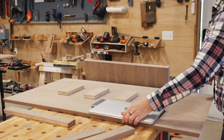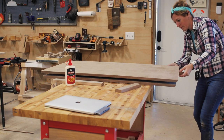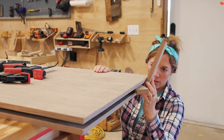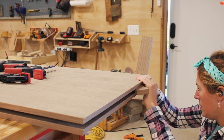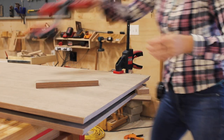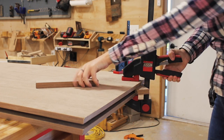Attaching the top was a little bit tricky since both pieces have a bevel that should be in line on all sides once in place. I wanted as much time to play with the arrangement, so I switched back to using DAP's Weld Wood glue which gives a much longer open time. I grabbed a scrap of the three-quarter to fit in the gap of one of the corners, then used another scrap to hold up against the bottom bevel and project its line up to the tops. I did this on both adjacent faces and moved the top so that it would be flush on both, then clamped the position down. After repeating that on a second corner I was very happy with the result, so I gathered up some weights and let that glue dry.